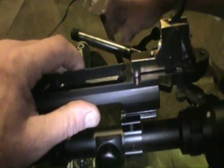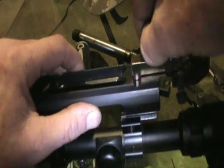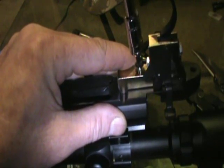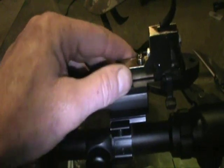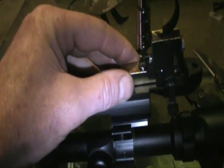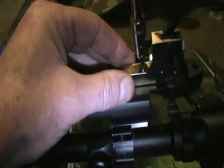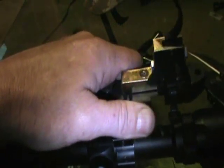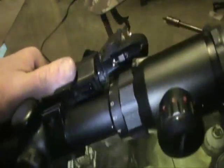Back that up a little bit, then lock that jam nut down. Make sure we like the tension. It's nice and light and we don't have much creep - there's just enough that as soon as the trigger moves it breaks. There's hardly any creep at all. It's all adjustable right here. If you can't tell exactly what it feels like, that's when we put it back on the gun and it'll start to feel more natural. Put it back on there with that one screw - very very simple system. Tighten this screw down, put the bolt in.